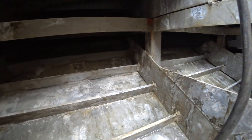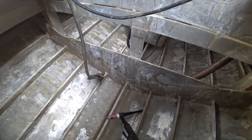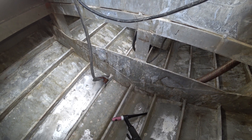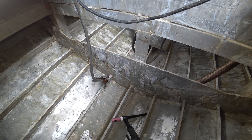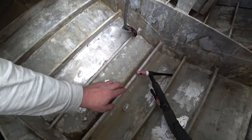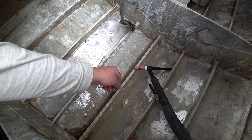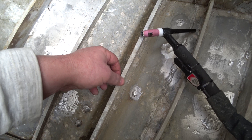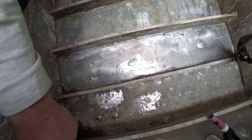The only concern is pitting in the actual hull plate. It's only about two millimetres deep in some places, but if there's already a pit, more moisture will sit in it, it'll corrode more, and eventually it'll go through. But it's a six mil plate boat - we've only gone that much into the plate. If you had deep pits going down four mil you'd definitely want to get to that in time, but with six mil plate, a little bit of pitting like this isn't really going to do much.